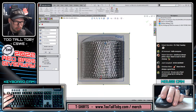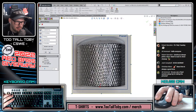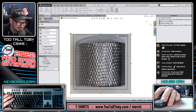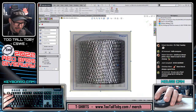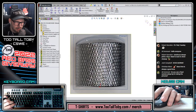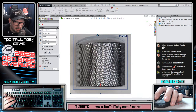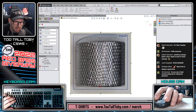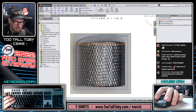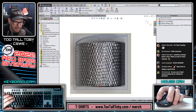Another good pro tip. All right, so now we can resize this to get it to match the black outline of our digital twin. I'm just going to start saying that anytime I'm talking about 3D CAD. It's not a 3D CAD model, it's a digital twin. Okay, that gives us the basic idea of where this thing should go. We're working from an image, so don't sweat it too much. You could always drag this to get the geometry to match the digital twin, but you basically just want this top line here to be at the same location as where the knurling stops. Having that fillet on there isn't really doing me any favors, so maybe that was a mistake to include it.